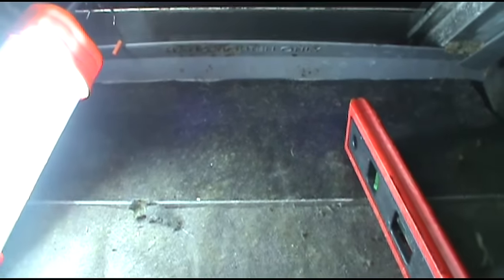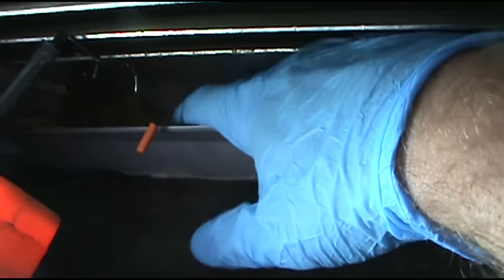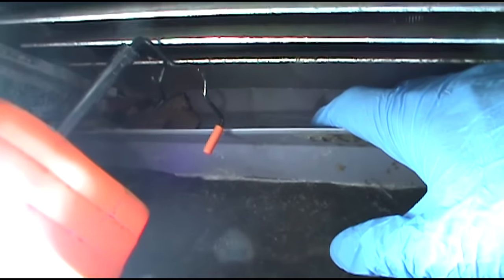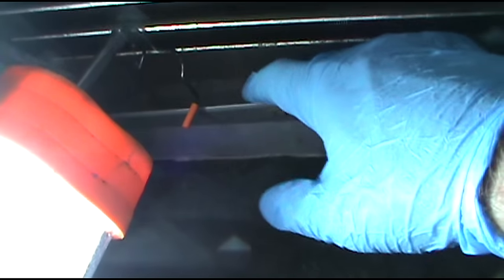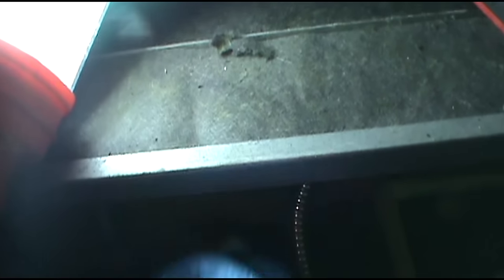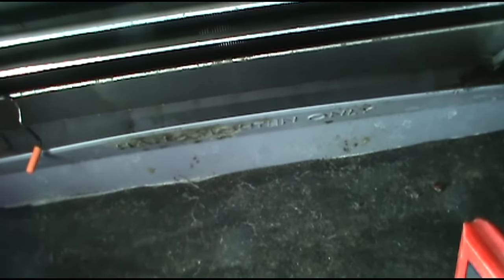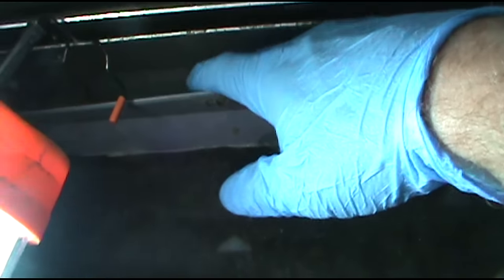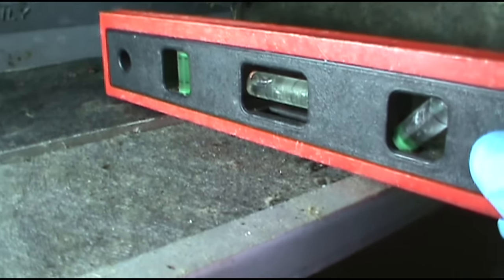And there's this pitch forward. We've put wood behind it and tried to bring it up. It helps a little bit, but it's just still not true. There's usually a little top that sits over the hole, and you would think that would help, but it doesn't. Somehow water gets into that float switch hole and shuts it off. I think just because it's pitched forward it's not balanced. We'll go suck the line out and it's not even clogged, and there won't be any water in the pan. But the float switch will be full and shuts the unit off. Big problem out here.